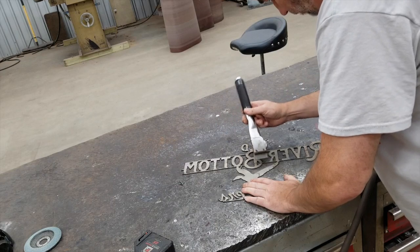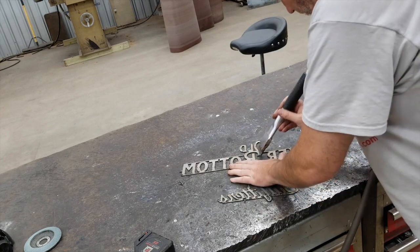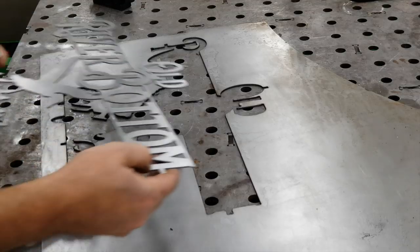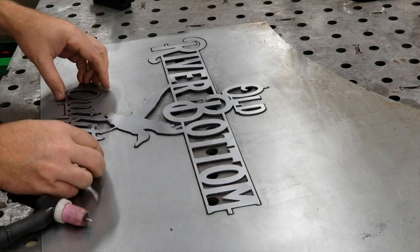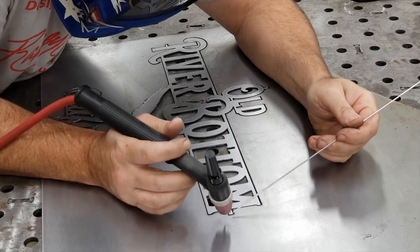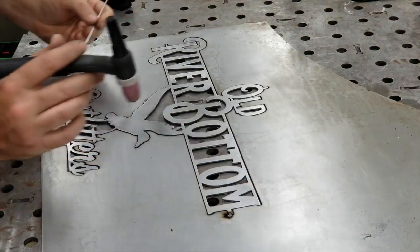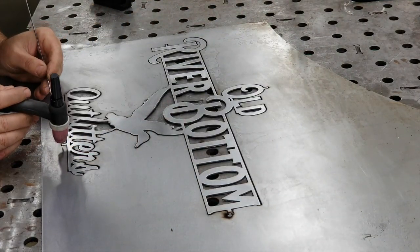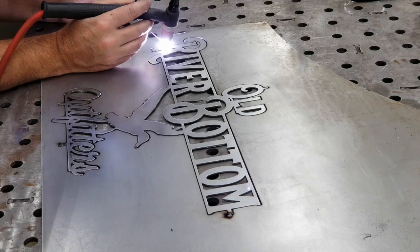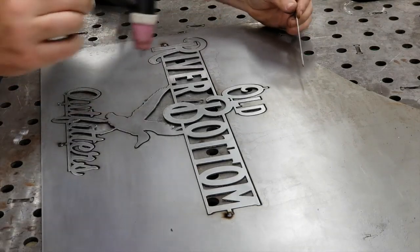So after this cut, I did a little bit of cleanup, did some dross removal on the back, and then re-sanded the front again because we're going to be using a Scotch-Brite pad — we want it to be clean and dry, no oil on it so the Scotch-Brite pad doesn't load up. You remember the little tabs I showed you in the CAD? That was so I could put this back in the template and just put a quick little fusion tack or blow across a little piece of stainless. Stainless TIG wire will settle down any popping and bubbling you might normally get fusing across a plasma cut edge. So we're just going to put the tacks back in, and this way we can put the whole offcut back in there to do our engine turning.